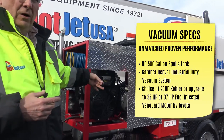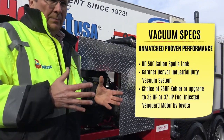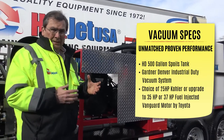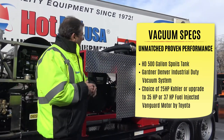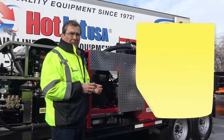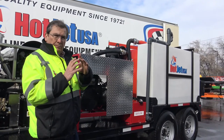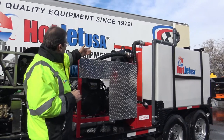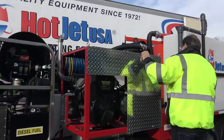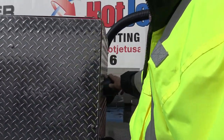This is a 5LR. On this one, it's a lot larger size max. We're able to get out right about 900 CFM. And so you could probably put a couple hundred feet on there, huh, Chris, to still achieve maximum suction, depending on what kind of hose you're sucking through. All of our primaries on it, you're coming out on a 4-inch out here. Maintain full suction on this unit.